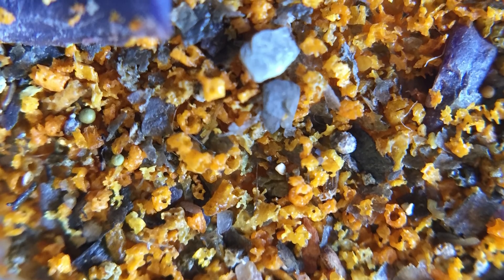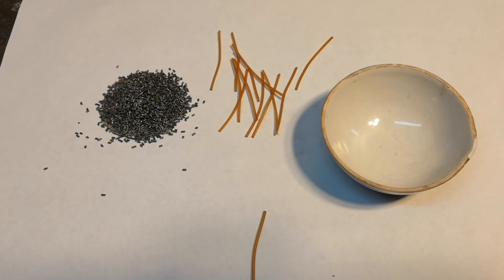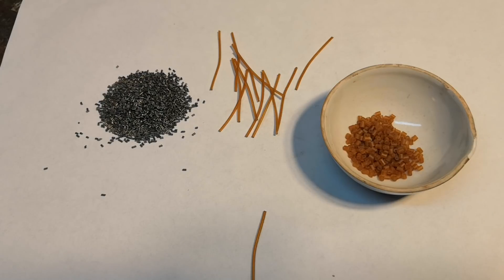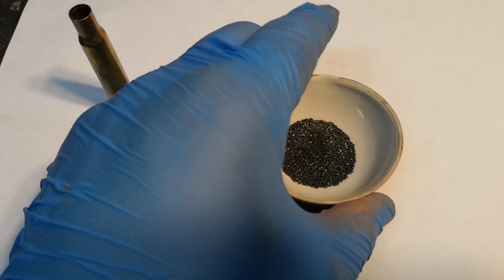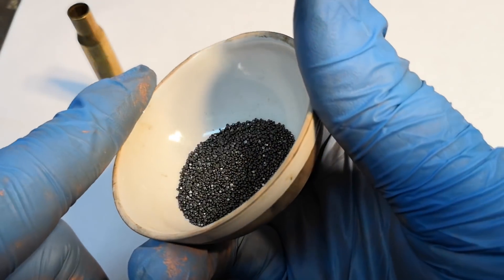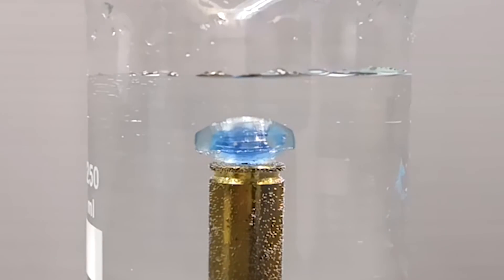Sometimes at shooting ranges you can even find some unburnt powder that clearly shows the enlargement of the hole. Historically speaking, tubular propellants have been extremely common since 1900, and in the first half of the century some strange shapes appeared — most notably the English cordite, which as the name suggests was composed of very long perforated cylinders, and the Italian solenite, which was similar to the typical tubular propellants but with a much larger hole in the middle. From the 1950s though, a lot of rifle cartridges started being loaded with so-called ball powders, composed of spherical granules with no perforation whatsoever. In those, the outer surface is treated with a deterrent that strongly reduces the burn rate, so as the surface of the grain decreases, the faster-burning material is exposed, and in the end a close-to-neutral or even slightly progressive burning behavior is obtained.